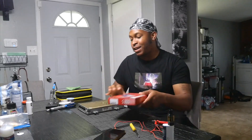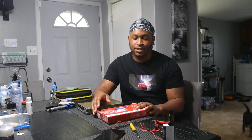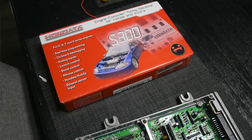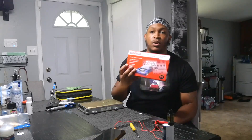What's up YouTube, I'm back with another video. In today's video I'm gonna be installing Hondata in my P28 ECU. If you don't know what Hondata is, it's kind of old school but it's new at the same time. What this allows you to do is change basically any parameters with your Honda ECU — timing tables, fueling tables, launch control, boost control, all that stuff.